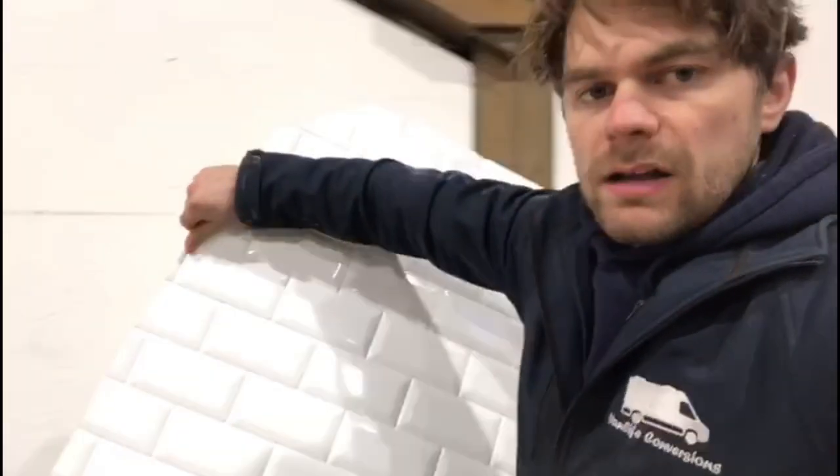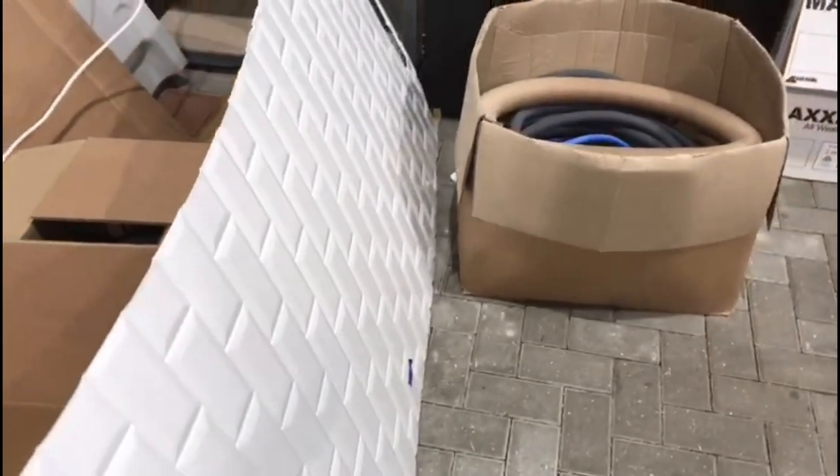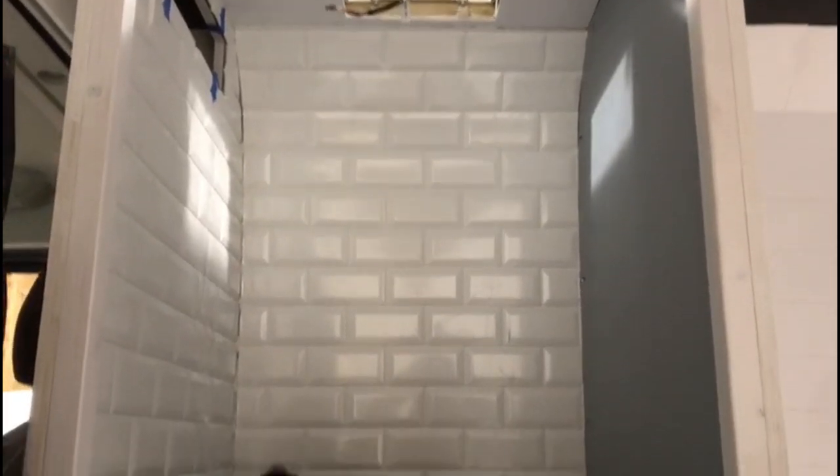I'm going to show you the Ricoh panels which we use to line the inside of the shower cubicle and make everything waterproof. You can see the Ricoh panel cut to shape for one of the side walls — these come as four-foot by eight-foot sheets. You can cut them with a jigsaw and they're metro tile style but 3D plastic panels. We've scribed them to match the hole in the top of the wall for the cubby hole, tracing the same scribe line used to cut the 18mm side walls, which saves time and keeps it accurate. We really like this product for van conversions because it's lightweight, waterproof as a single sheet, and you just seal the edges with silicone.